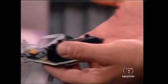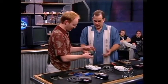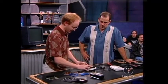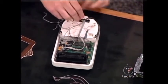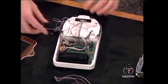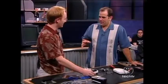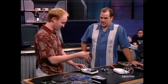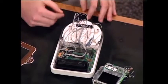This is the actual hacked 2600 board - you reduce about two-thirds of the board by removing the switches and stuff. So how do you make this fit into the case? It goes in right like this, down into the spacing. We have the second player joystick port down here so you can plug in a second joystick and fight your friends in combat. There's an aux power input to run it off the wall - a lot of people do that. And there's an AV output jack to plug it into your television. You never see that in a portable.